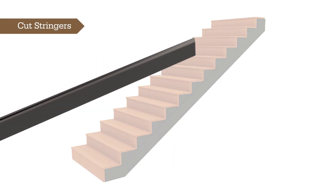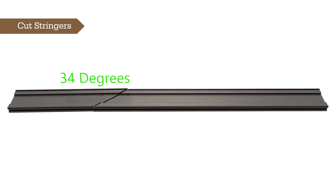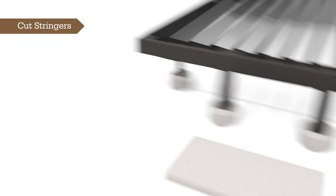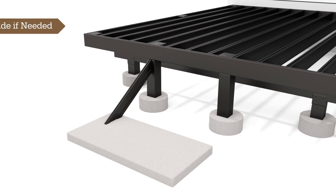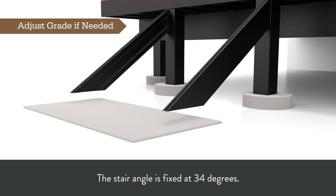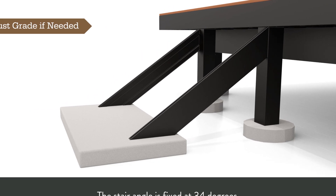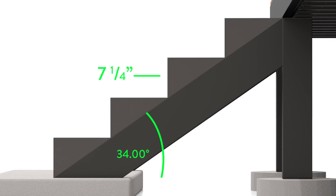To begin, create the left and right stair stringers by making two angled cuts on the rim joist. One end is cut at 34 degrees and the other end at 56 degrees. Each stringer will rest flat against the deck frame on one end and flat against the ground on the other end. The stair angle is fixed at 34 degrees, so in some cases you will need to adjust the grade to reach the bottom of the last step. Please note that each step creates a 7¼-inch rise over a 10¾-inch run, resulting in a 34-degree stair angle.